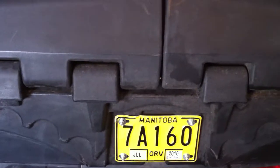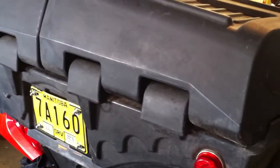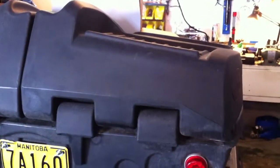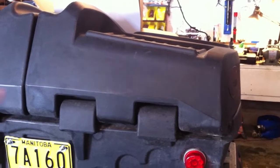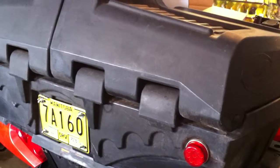I could actually post pictures on this video of one of the setups I came across 2 years ago. They were using a 2-stroke pump, and that's a little bit lighter, and you don't have to worry about the low oil shutdown turning off the motor. But in this case, I might rewire it so it doesn't. And anyway, I will replace that with a 25-gallon tank, make it a quick release deal, and then put the pump on it, and then have, I don't know, a 10-foot length of garden hose, and a little bracket to carry the suction hose so that I can set it up to draft from a stream, or I could even just use it stationary with the end of the hose in a stream or a little lake, pond, whatever you got, pool.